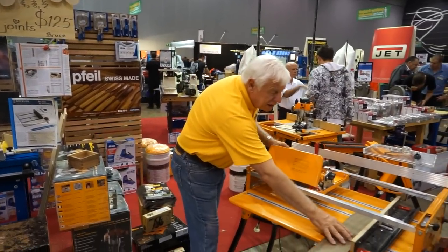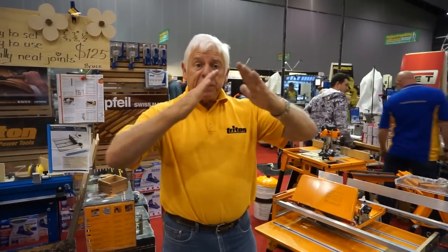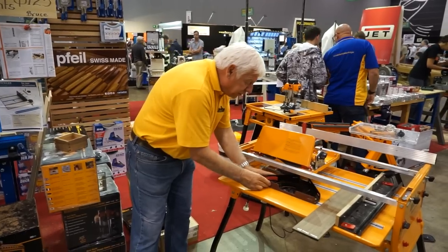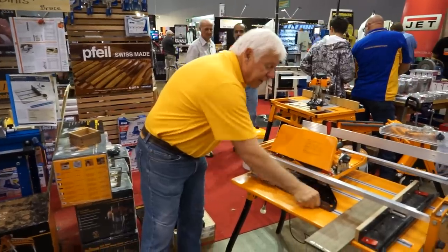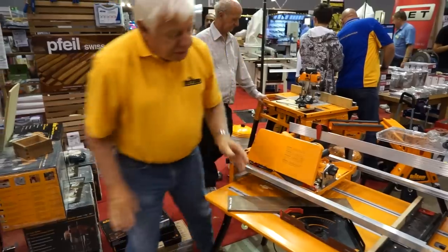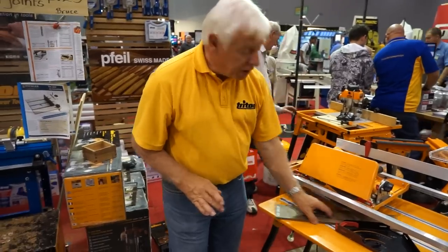The basic action is holding the timber and pushing the saw through. Sometimes, if you're making a dog kennel or a carport and you want to get some angles — maybe an apex or a hip on a roof — that's very easily done with the protractor. The protractor drops into a captive track and locks in position. Once locked, I can push through the piece of timber. It has sandpaper on the edges, which holds the timber absolutely firmly against the protractor and prevents it moving during the cut.